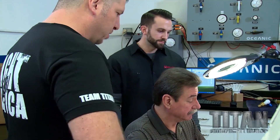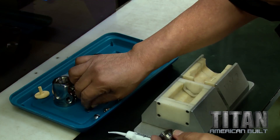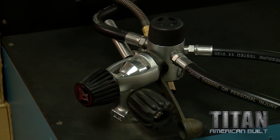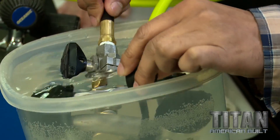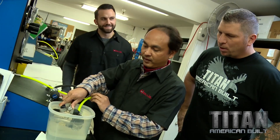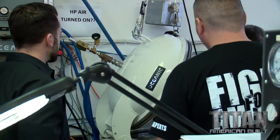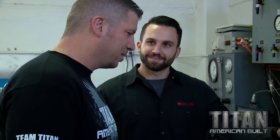So what do you think about the 360 brass compared to the titanium? The weight saving is just unbelievable. We've got about 45 component parts going into this assembly. It's going to be dived to a maximum depth of about 220 feet, so it needs to work perfect. It's all assembled and it looks awesome. What Sham's doing here is pressurizing the unit — if there were a leak you'd see a massive amount of bubbles. Zero bubbles — no bubbles. We take it to the lab and go ahead and dive it. What we're checking for is obviously whether the unit will fail at depth, so hopefully your parts hold up to the pressure. If it fails, it's probably your machine, not my parts.